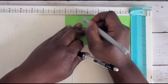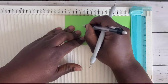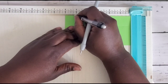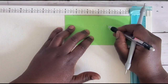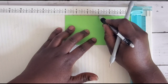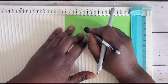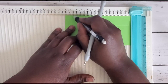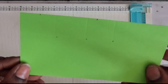Continue with a mark at four and five-eighths at the score line, then at five and a quarter at the top. So to recap: two and a quarter at the score line, three at the top, three and three-eighths at the score line, four and five-eighths at the score line, and five and a quarter at the top. Your points should look like this when you're done.